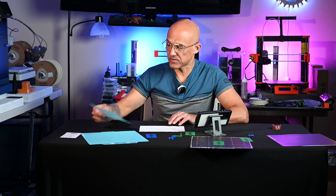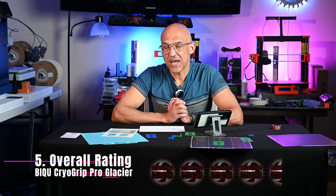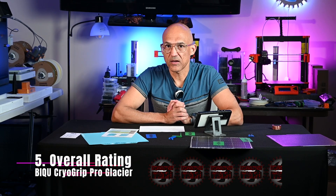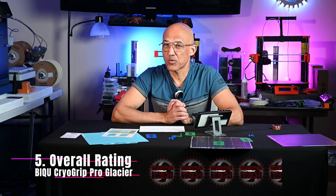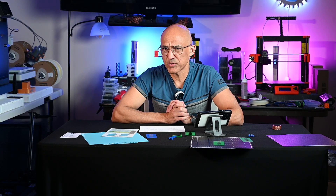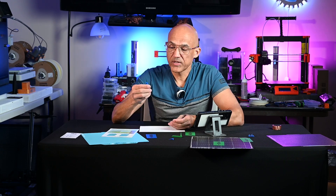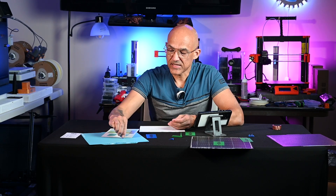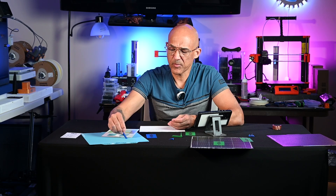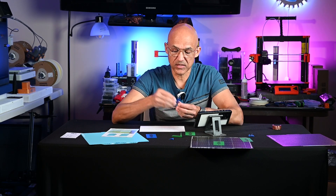Overall rating: I'm going to give this 4.5 Directed Tech Gears. It is a great plate. If it were magical, I'd probably give it 5 stars. I did have to play around with the temperatures a little bit to find one that just worked for this little torture test. Printing something this small at that diagonal puts additional stress on it — every time the print head touches the top, you're working against your adhesion. That's why this is a torture test.